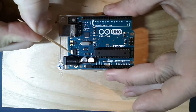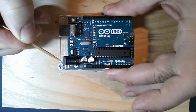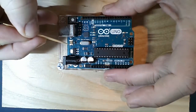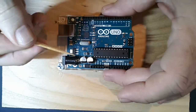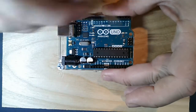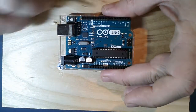Then the board usually goes through a washing machine. Inside the solder is a material called flux - it helps solder stick to the pads and pins by chemically cleaning them. It's actually an acid mixed in with the solder. Any residue of the flux has to be washed off the board - usually you wash the whole board. That's how all the surface mount components are done.